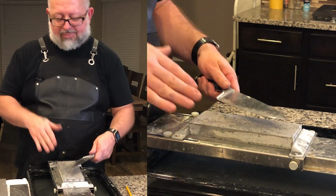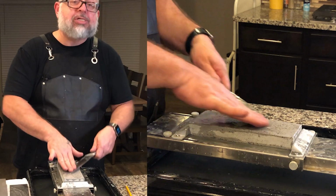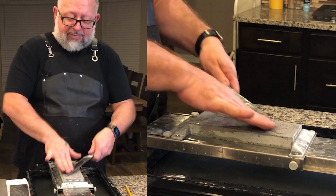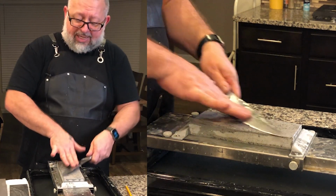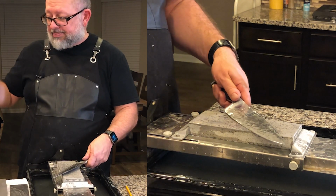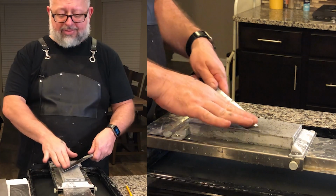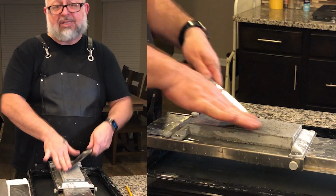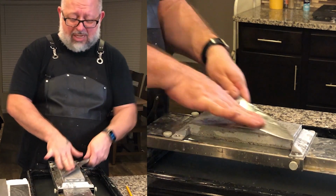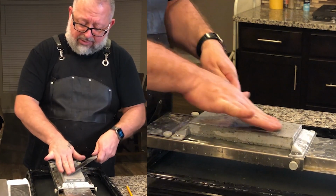And then if I needed to jump back on there, I mean, traditionally, you know what we've always done, and we've had great success. We have gone through the progression of stones. We go on kangaroo, the rough and the smooth. Then I have gunny juice at 0.5 micron on leather and nano cloth. That is everything I need to make sure that these apexes are clean at 0.5 micron. So you can see a nice dark slurry on here.